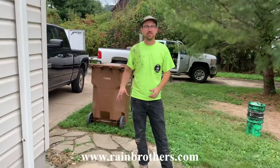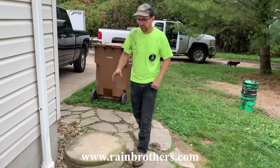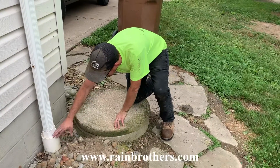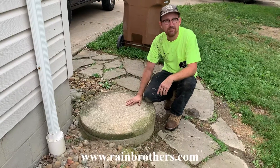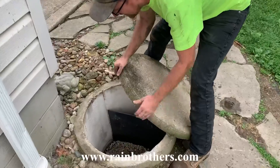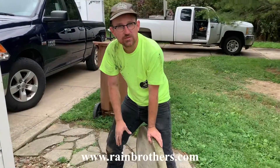I wanted to save this inspection point until the end, after you could see what was inside the cistern and what accumulated at the bottom. We've gone through the entire checklist of outside components, ending at the downspout — making sure the pipe is elevated at least eight inches and possibly siliconed. Now I want to cover pre-filtration. This is an attempt at pre-filtration — a precast, quote-unquote, sand filter. In my experience, these are not to be used for cisterns; it would actually be better to have no filtration than to have this.